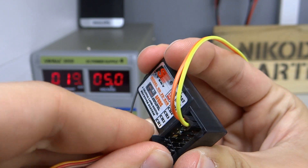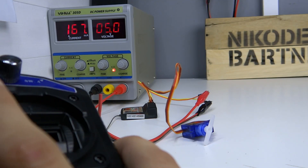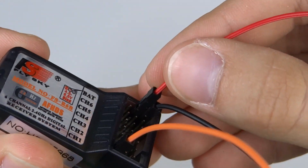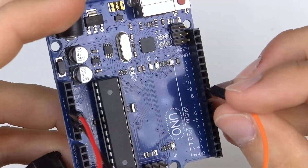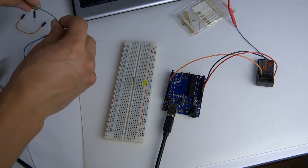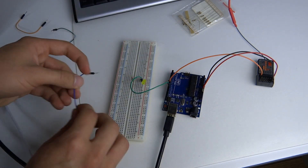Make sure that you plug it in correctly. Now we are able to wirelessly control a servo motor. To reach channels with an Arduino we have to connect five volt, ground, and signal wires to the Arduino. The signal wire should be connected to pin number nine. We will also connect an LED with a 200 ohm resistor to pin number 10 on the Arduino. Because of the resistor I used a breadboard for that.